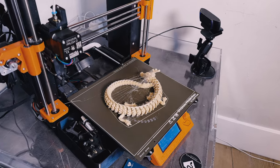They have a super cool look to them and these awesome articulating joints. I wanted to take it up a notch and try to print this out of wood PLA, which is notoriously somewhat difficult to print with. First, it's highly abrasive so things like brass nozzles wear out extremely quickly, and second, I've found it prone to things like stringing.